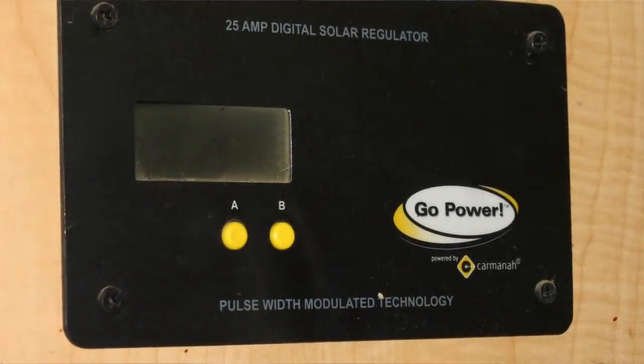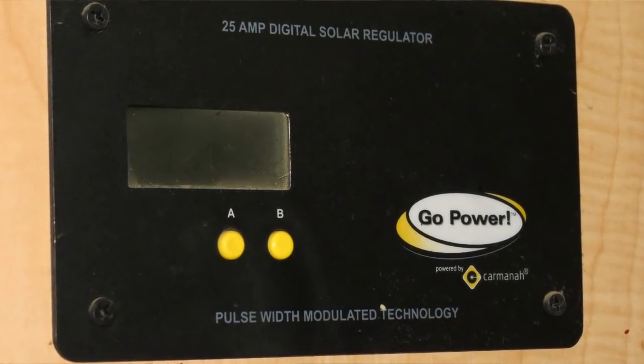That's just the way I roll. I've got solar but in the winter we don't have much solar energy, especially here in the Pacific Northwest. Even in Arizona in the winter there's not much solar on a clear day. Now, too many battery videos say all sorts of crazy things. You can mix and match battery sizes — you can even mix 6-volt with 12-volt batteries as long as the 6-volts are connected in series and then in parallel with the 12-volts. Electrons are electrons; as long as everything is wired correctly, it doesn't matter.